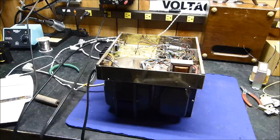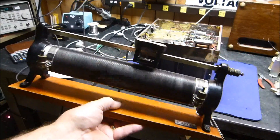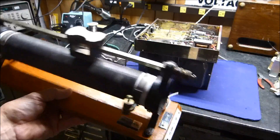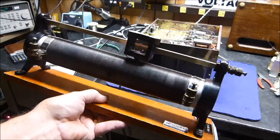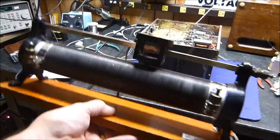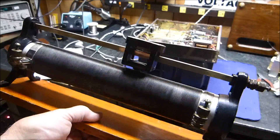There's one other thing I wanted to show you that I picked up the other day — look at this beauty. Remember this from a high school physics lab? It's a 23-ohm rheostat that handles 4.3 amps. I thought it would be cool — I can slide it and have anything between zero and 23 ohms as a load for transformer impedance measurements. But guess what — this thing is not worth a hoot. It has so much inductance it's just unusable.